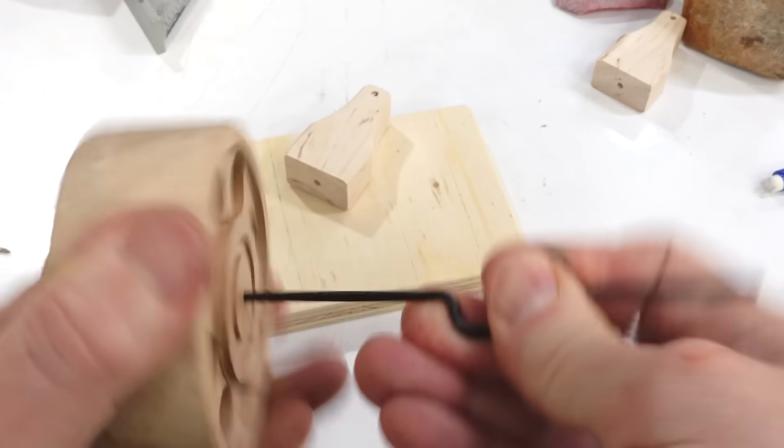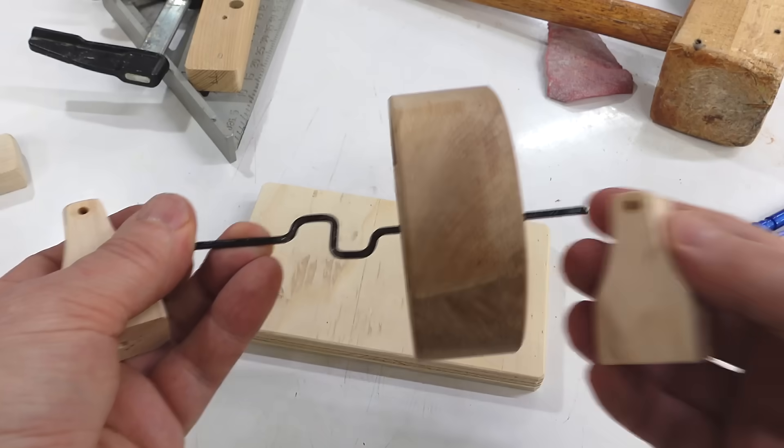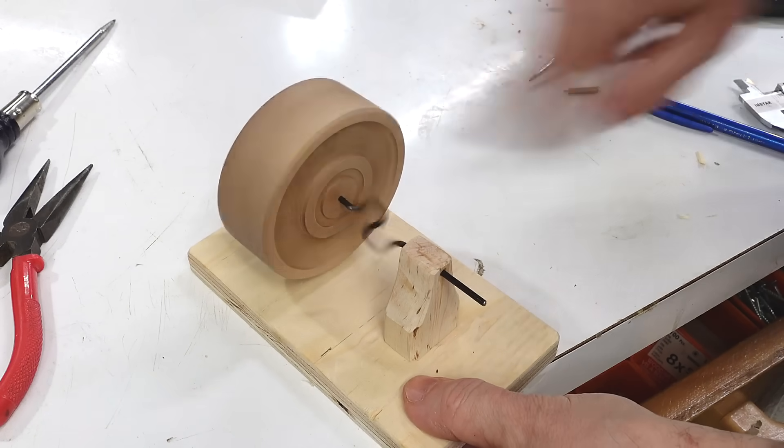Trying the flywheel on the crankshaft, I still have to bend that crankshaft a little bit to adjust it. I'm just running the coat hanger wire straight in holes in blocks of wood — I don't have any small ball bearings like that kicking around. I guess that spins true enough now.